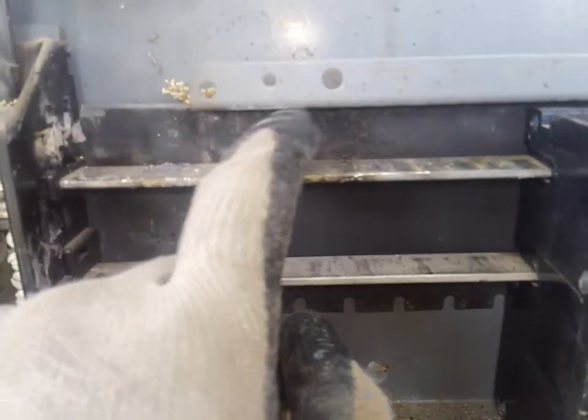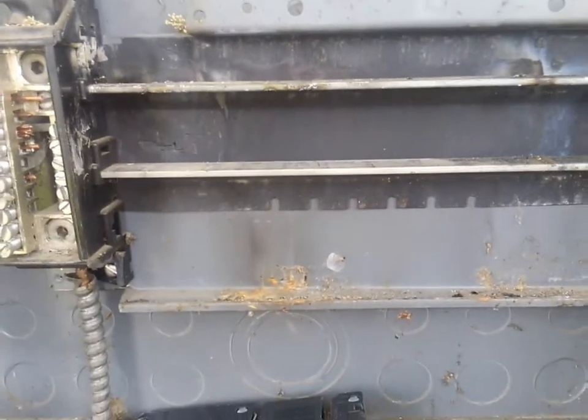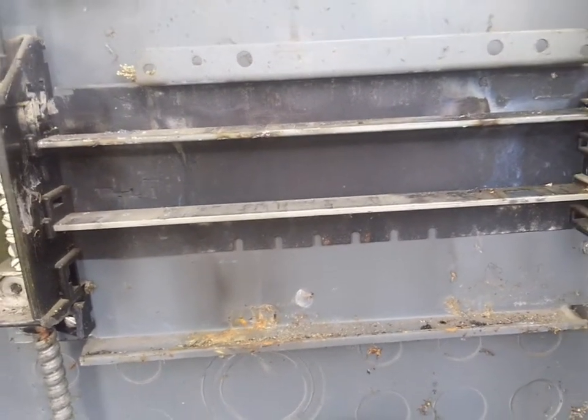Look — bad, bad, worse. This one, you see how they're hard to take off? They kind of stick to the bus bar. That's the number one issue with this Zinsco panel. You can get away with circuit breakers temporarily.